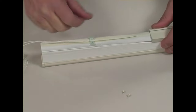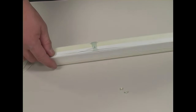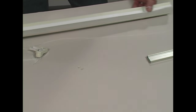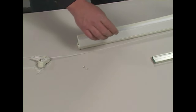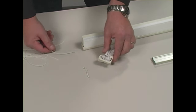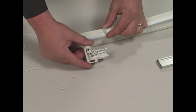At this point I'm going to pull my cords all the rest of the way through — I've undone them out of the bottom rail with the pockets and ferrules. I'm going to completely remove the head rail. On larger shades, I may want to take a rubber band and wrap it around the fabric to hold it in the stacked position on each end. Then I'll pull the dead cords out of the shading and pull them through my cord lock. My cord guides and cord lock are still good.